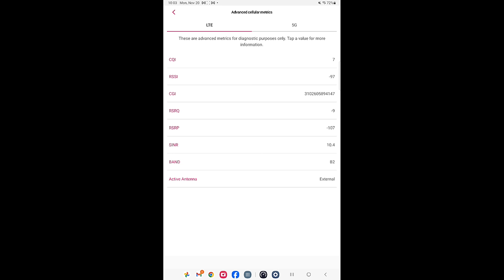So from that standpoint, if you care about the speed and the performance, you really got to spend the money and go for the Waveform. Get the better antenna cables. If you do get any cables, don't get ones this thick if you're going to run any distance on them, because you're going to have so much loss in the cable that the antenna actually is not going to give you any type of reception gain. So those are my findings.